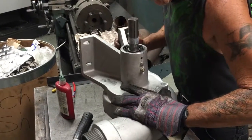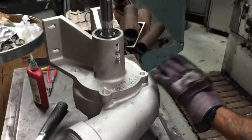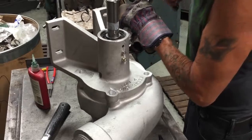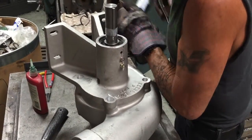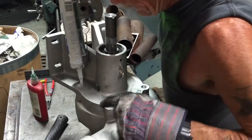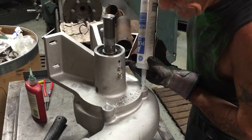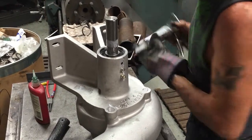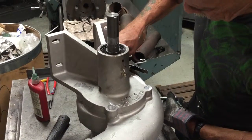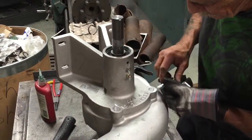Put the housing on and turn everything over, line up your bolt holes. Put silicone in the bolt holes to stop the pump from leaking water up through the threads and making a sprinkler system. You only need to do three of the holes — the bolt hole at the top where the discharge is has a sealed hole that will not leak.